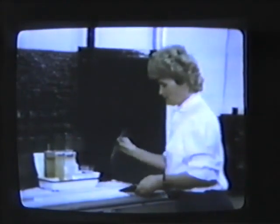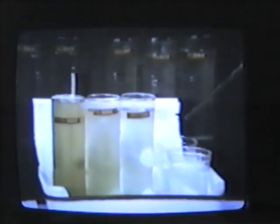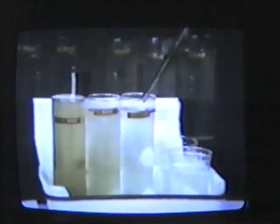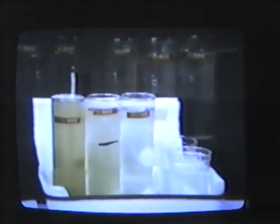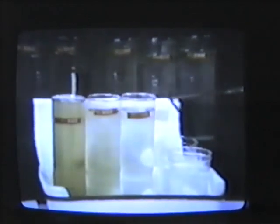The compounded rubber stock is conveyed to the steel rolls of a rubber mill, where it is further worked and blended into a smooth, even sheet. The mill room is one of many quality control checkpoints in the manufacturing process. A sample from every Banbury batch is checked for physical properties in the mill room control laboratory before the batch is released to production. Specific gravity, for example, is verified by dropping a small piece of mixed rubber into liquids of calibrated density. The sample must float in the first one and sink in the second.